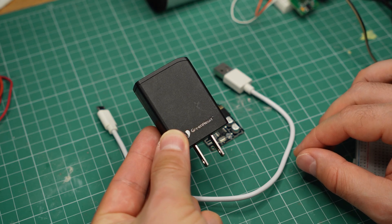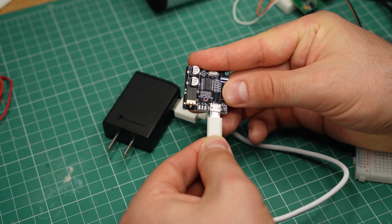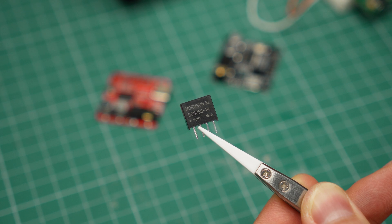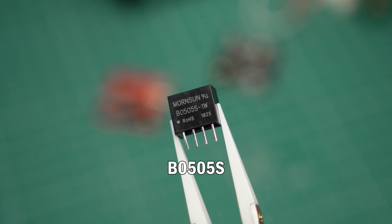With these receivers, you can avoid a ground loop altogether by powering them from their own dedicated power adapter. If you are using them for a custom DIY speaker, make sure your wires are as short as possible, or use one of these 5V isolating transformers — 5V go in, 5V go out, and the ground is separated so you get no ground loop.